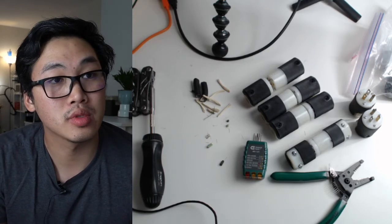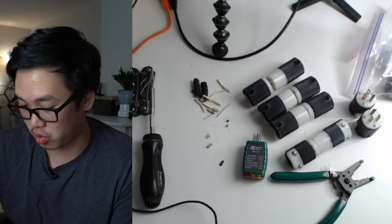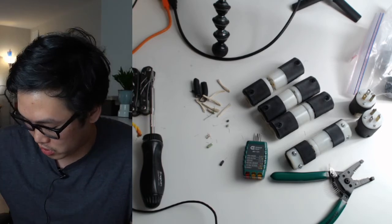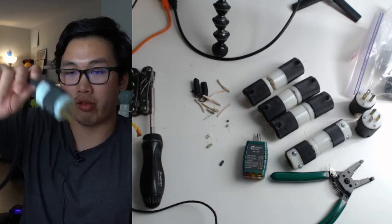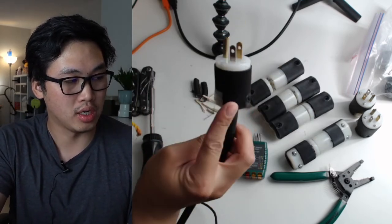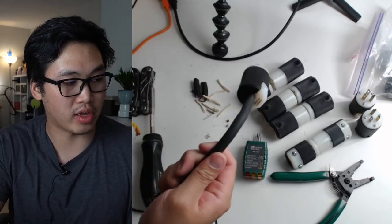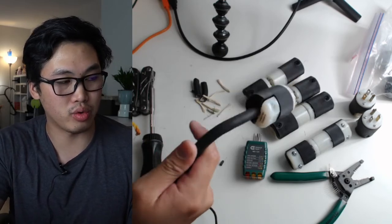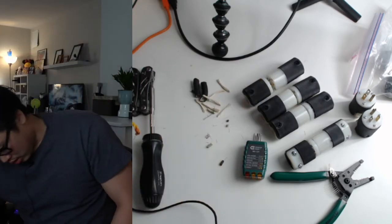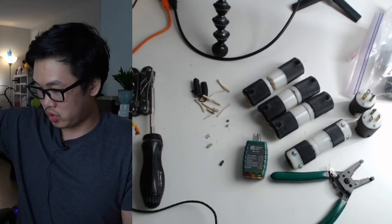Okay. What's a stinger? I just got here. Oh, never mind. Stinger is a term for extension cords. These are for the film and television industry because these are a lot more heavy duty than your normal orange one from Home Depot or whatever. You got these heavy duty and water resistant ends here. This cable is outdoor rated. It's very thick. It can carry a lot of current through without having it drop off and lose it due to heat and whatnot. Let's see if I got some room to plug into. Okay, so I actually got a plug right up here.